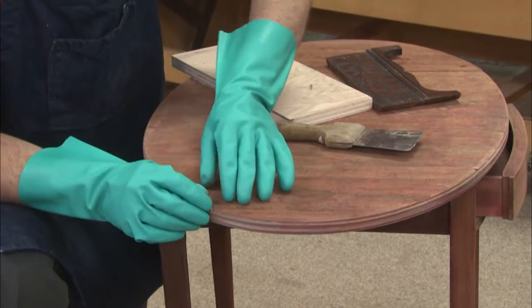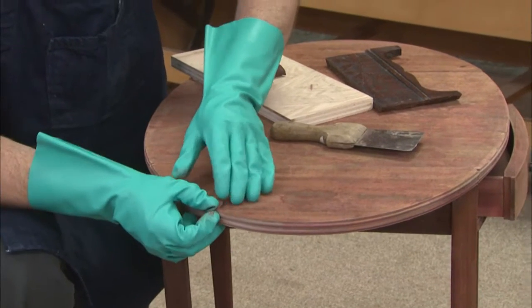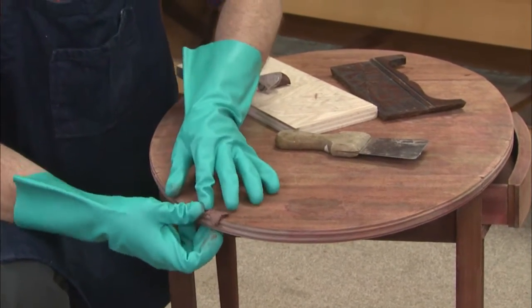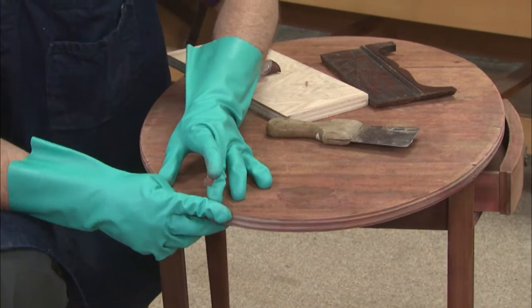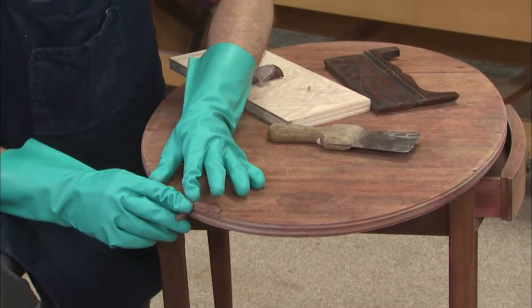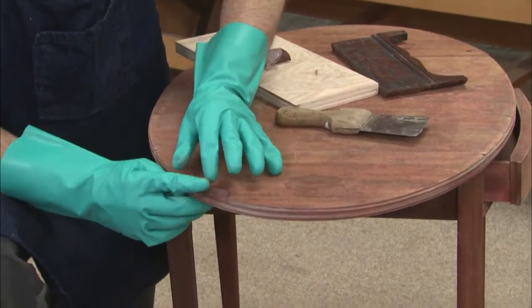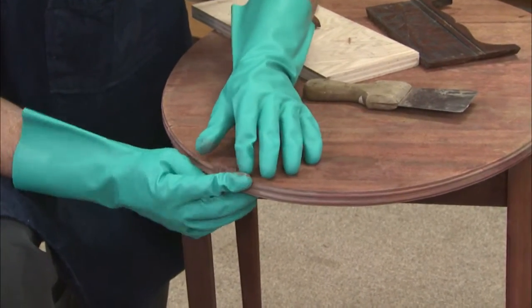So what I'm doing right now, and that epoxy is actually warm to the touch, and that has been thoroughly cleaned out, sanded and brushed out with a brush. And I'm going to overfill that. And do not do this bare-fingered, whatever you do. And we're going to let that cure out. Okay, and we'll sand that down.